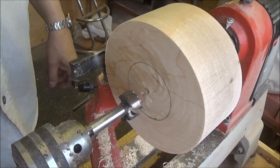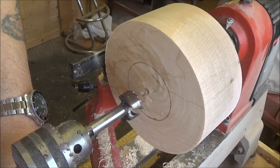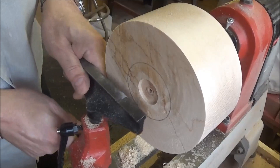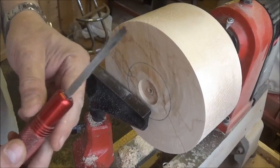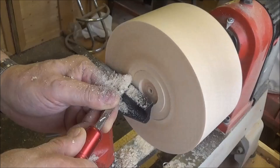Now I can reverse it. I'm just going to drill the indent for my little logo disc with the one-and-an-eighth-inch forstner bit — that's it, it's my age. That's it, now I can get on with the mortise. Again using my little skew chisel. That's the mortise cut in.